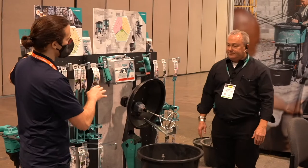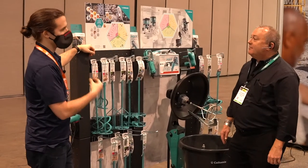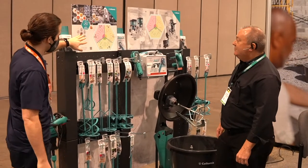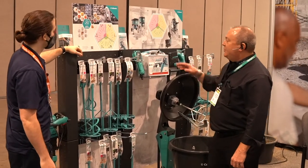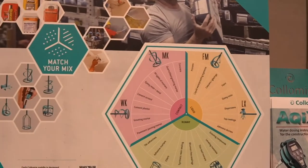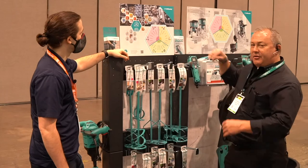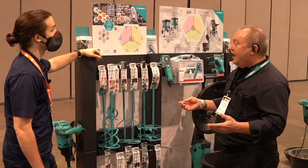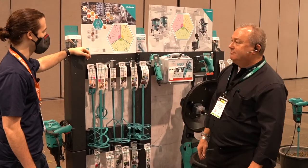So folks that may not want to switch over to these mixing motors and want to stick with their drill can still use these paddles — they'll still fit into the drill. There are also these wonderful diagrams that break down what each paddle is for and the different kinds of materials. We call this a mixagon. The idea is that the contractor can look for the type of material he's mixing and then see which style of paddle makes the most sense. It's a little bit of an educational thing, because the goal is to do the best mix possible, and one of those factors is to pick the right paddle. If we can help him come up with the right choices, so much the better — make it easier for them.